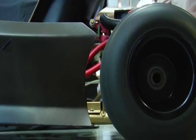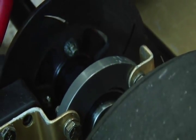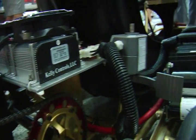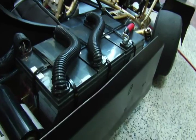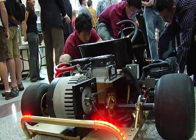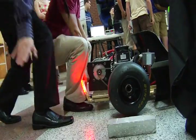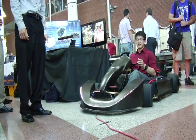When you're generating electricity back from the motor, you can capture as much as possible with the capacitors, as opposed to a battery where you're limited to the maximum charge rate of the battery. When you're braking, that regenerative braking is charging these capacitors, and when we hit our button, it just discharges all that energy instantaneously and gives us a power boost.